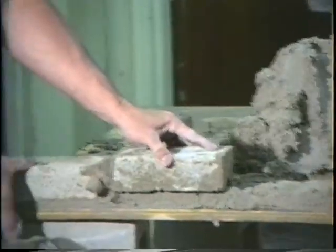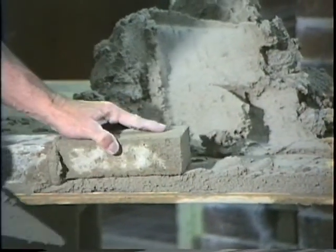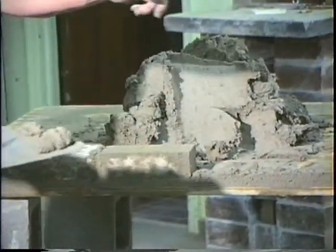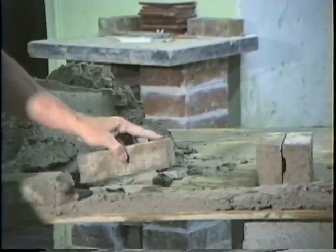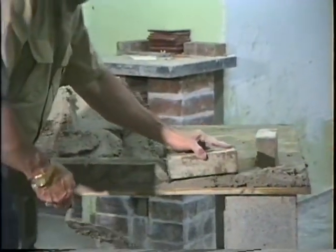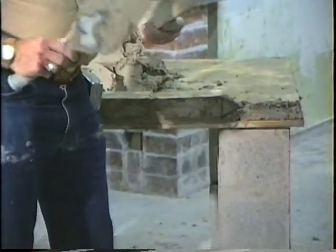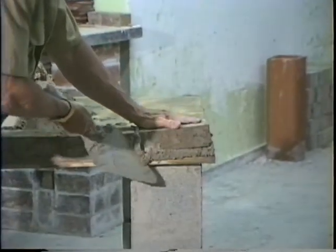Thumb here, just like a while ago. Use your eye. Okay? Use your eye. Throw that head joint. Use your eye. There's a rock under that. I can't believe it. My goodness. Cut that mud off using the point of your trowel, just like we were doing. Drag it down. Use the point. Make sure you got the solid bottom instead of the one that's got the cut, because people will see that out there. Lay it down.